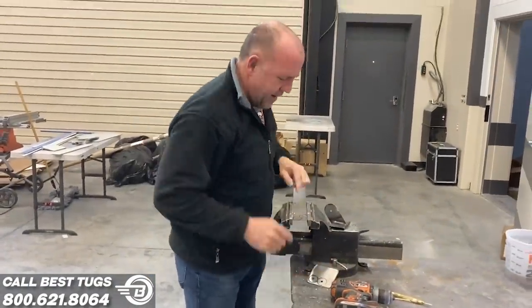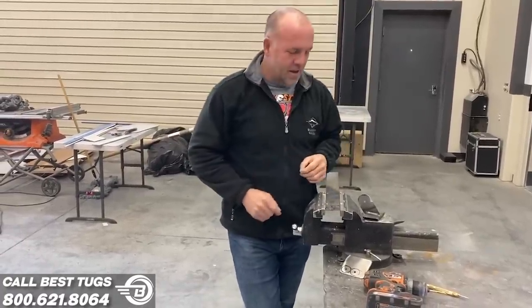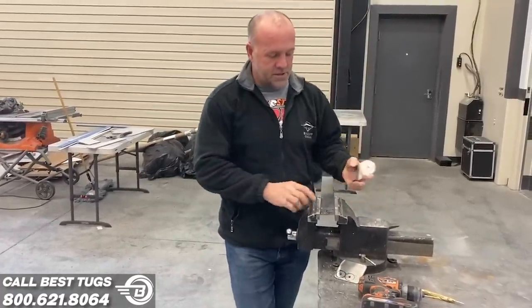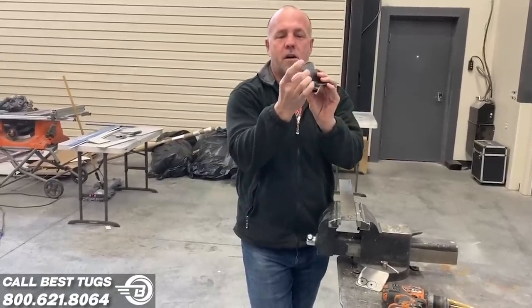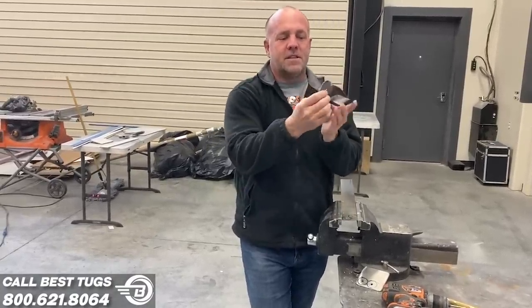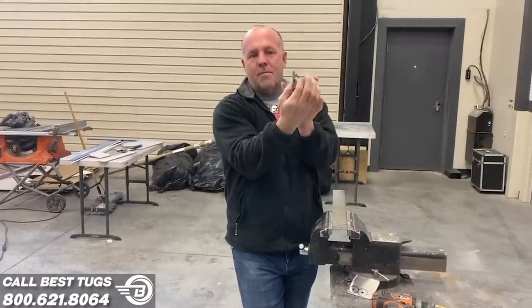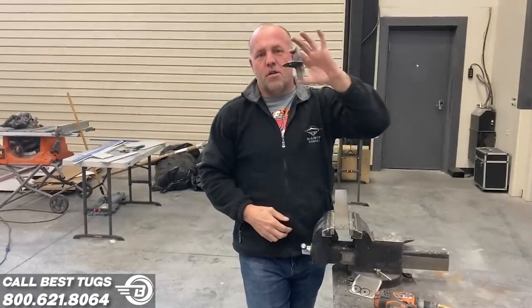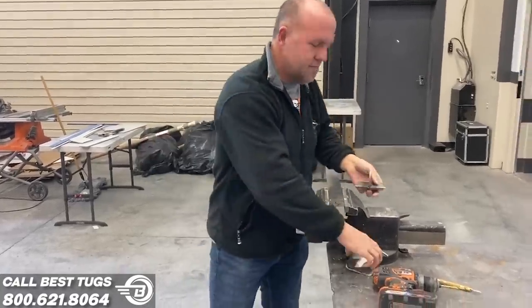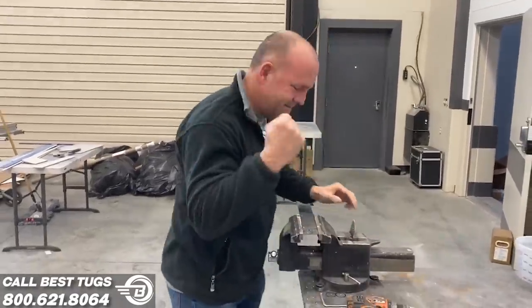All right, guys. I need washers, but I need them to be chromoly, so I can weld them to chromoly. So I'm just drilling my holes, gonna make washers, and then I'm gonna weld them onto this. I need this bracket to be really lightweight, so I used a thin wall, but I need to thicken up the area that I'm bolting the two pulleys to, so I gotta do chromoly. I don't have chromoly washers, so we'll just cut some up, make our own, weld them onto here.